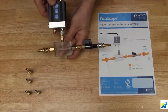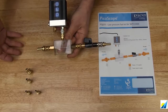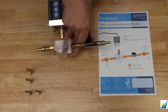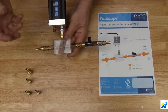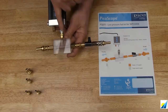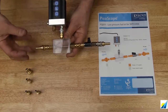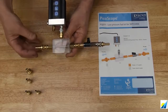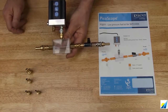Now, why the stop tap? Well, imagine we have the transfer pump here contained inside the high pressure diesel pump. We can close this off whilst the engine's running. The transfer pump is now trying to pull fuel from the tank, but it's met with a restriction here. Here we can measure maximum negative priming pressure. We can test the efficiency of the pipework from the site block up to the transfer pump, including the transfer pump itself.